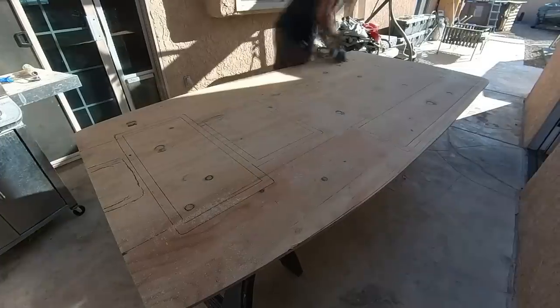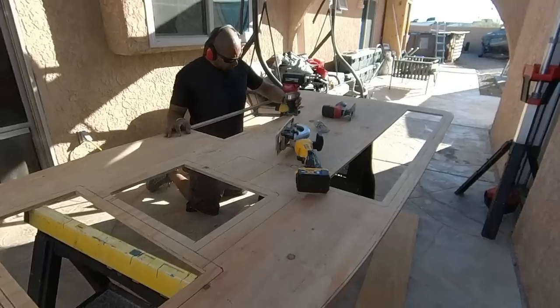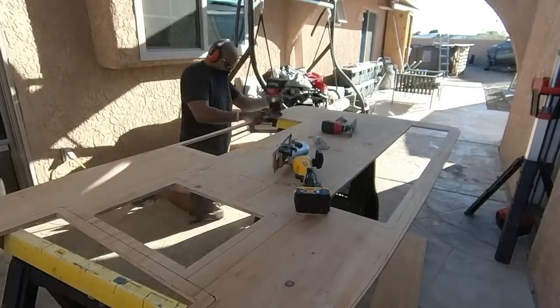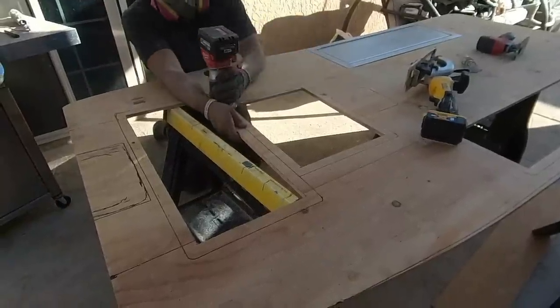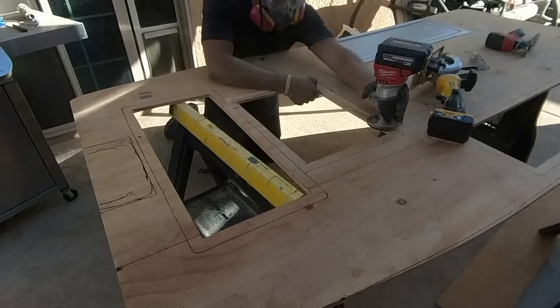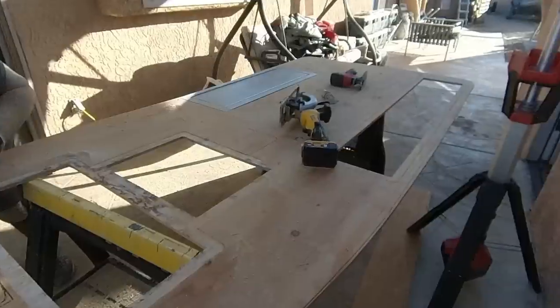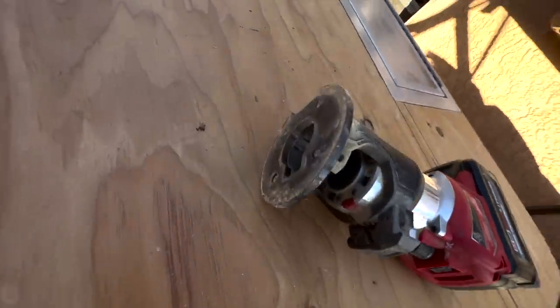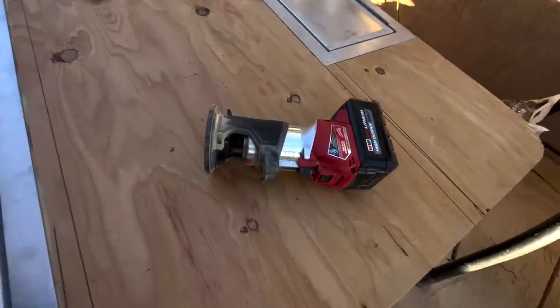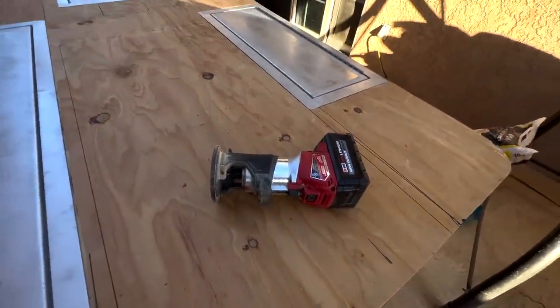Now that the grid is drawn, we make our cuts — it's on the inside of the ledge. These hatches have a hole size and an inch-and-a-half flange that drops out. So we're cutting out the hole size and leaving an inch-and-a-half flange that we are routing out 1/16th inch down, because these hatches are at that thickness. They should ideally sit flush with the rest of the deck. This concept will carry over to anybody using wood for a deck who just wants a really nice quality hatch that is not going to blow up in a year. It's working out like I thought — 1/16th inch, router in, half-inch router bit.